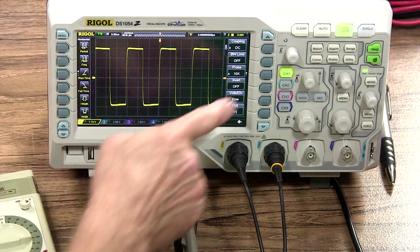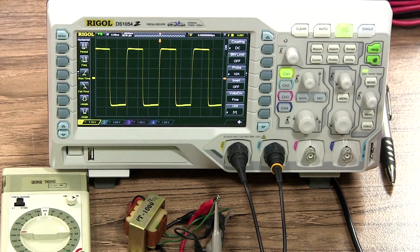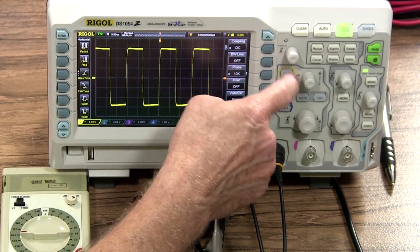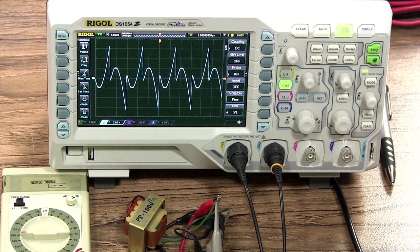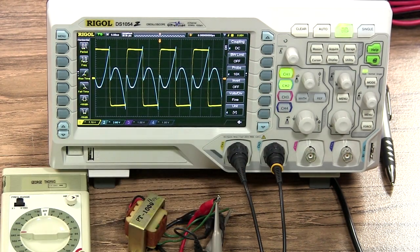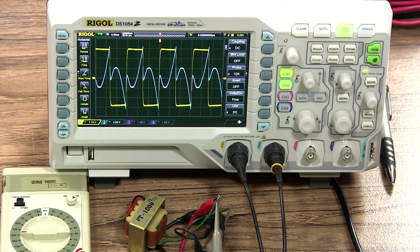All right, channel one here on the scope. That's the signal leaving the oscillator going into the inductor. Square wave. Let's look at channel two. What do you think it's going to look like on channel two, Tommy? Wow. Like cursive writing? That's a lot different. Yeah, that's very different. That's not exactly what I was expecting to see. It's not. Let's overlay our original trace there. Wow. You can see it's the same signal because it repeats at exactly the same intervals.